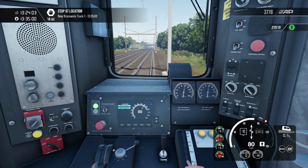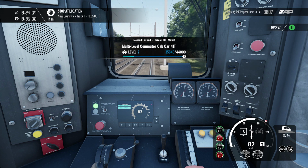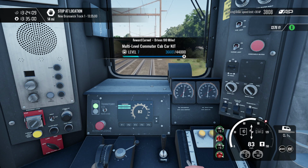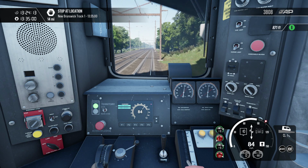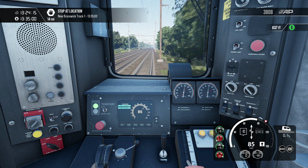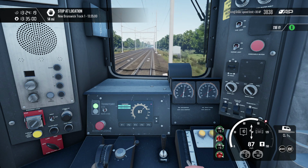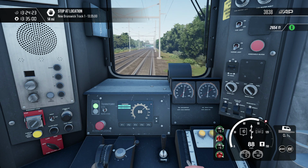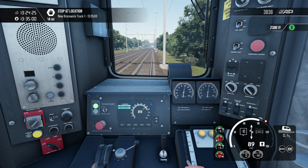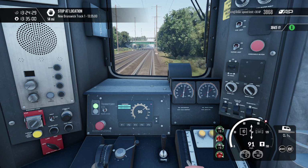So I didn't want to confuse people by running these demonstration trains from the locomotive, because then when I go to graduate the brakes off coming up into the final station stop, you can't really tell on the locomotive how much you're graduating off, because the brake cylinder pressure on the locomotive is going to be 0 if the dynamic brakes are being blended in.